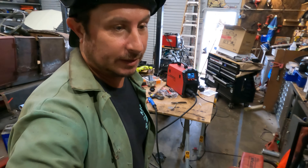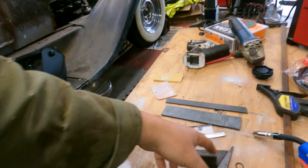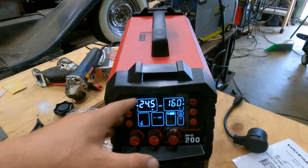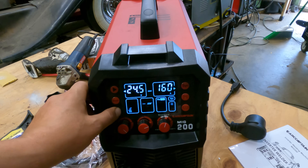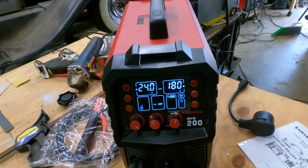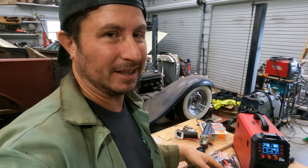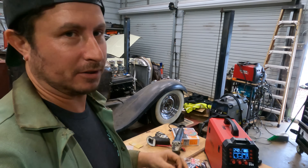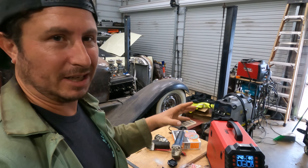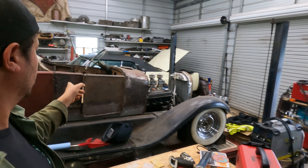I'm going to go the other direction — hook it up to 220 and weld some really thick stuff. Going straight for the jugular with some quarter inch steel. On 220, this will now go to 160 amps versus 120 amps on 110, which seems to be the max for 0.030 wire. If I shift it and pretend I'm running 0.035, I can get it up to 180. So this welder maxes out at 180 amps MIGging, even though it's called the MIG 200 — I think the 200 amp rating is only on scratch start TIG. Still more than enough juice to do anything like this.